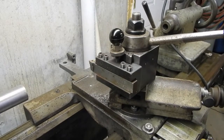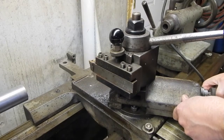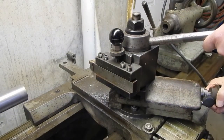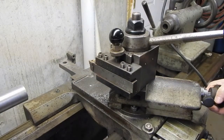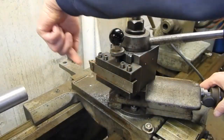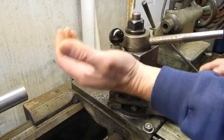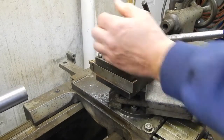One thing I noticed last time was the cross slide has a lot of play - quite a bit. I've got to readjust the jib screws on the cross slide. However, I don't think that's going to account for my problem, because when making the cut the force pushes back against the bit and is going to keep things over during the cut, not easing up until it's over. But I'll tighten them up and do a test cut.